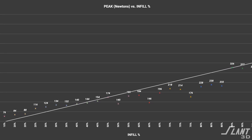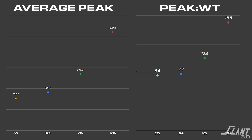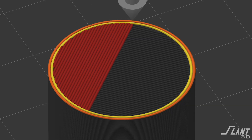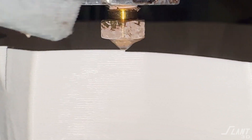Those tests went pretty much as expected — a linear increase in infill created a linear increase in overall strength, following good mechanical properties. But an interesting thing happened: once we flipped into 90% and 100% infill, both the strength-to-weight ratio and overall strength radically shot up, despite it still being a linear increase in material. We can hypothesize this is probably due to the overlap of the individual rastering lines and the increased heat density — since the infill is not spaced out enough for airflow, the beads of filament do not cool as quickly, giving them more time to adhere and bond, creating a more isotropic-like part.